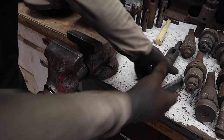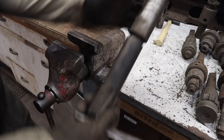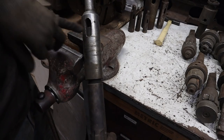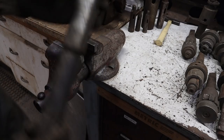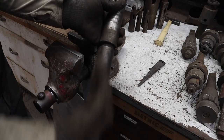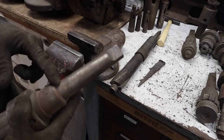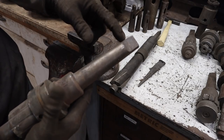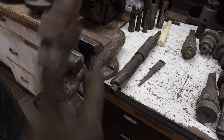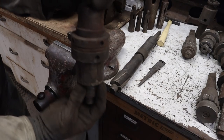Alright, so this is how a drift works. Basically, they're a tapered piece of metal, and you have these holes in the sides of tools. The way that they're inserted is just friction. They're just hammered in because the shafts are tapered, thicker toward the bottom, skinnier toward the top, allowing a good snug fit, especially once the tool touches and starts getting pressure put down on it.